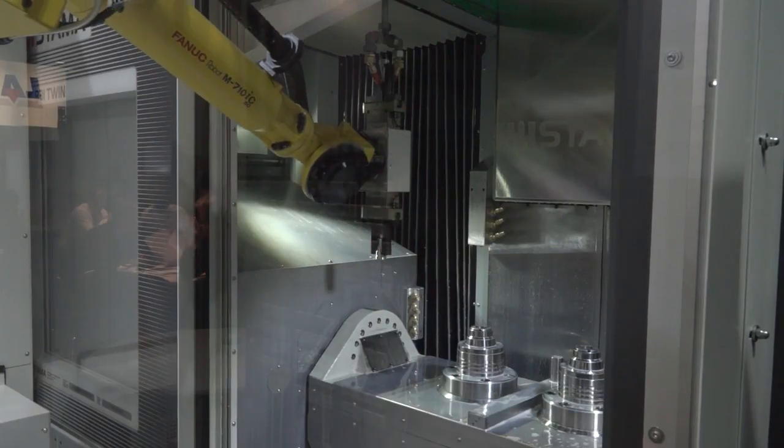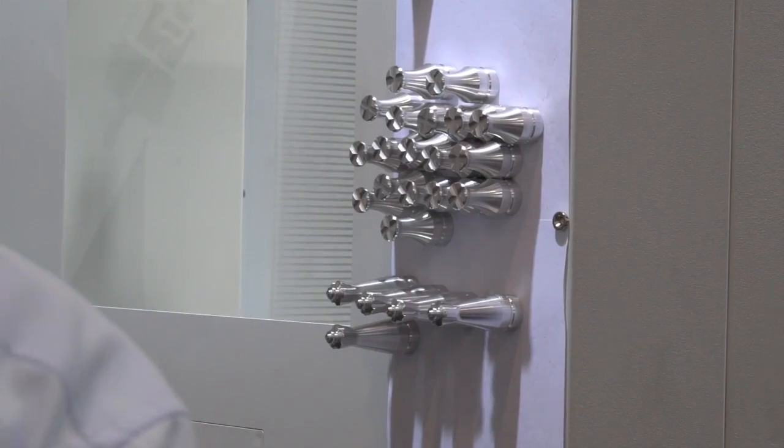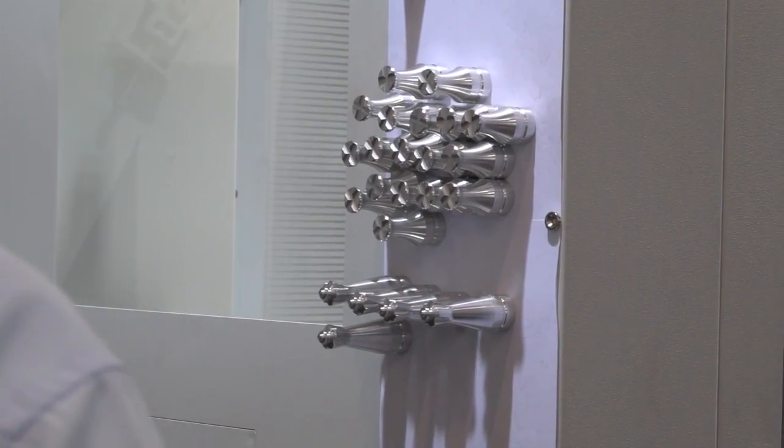And with it being a very fast machine, often with fast machines they're only good for cutting aluminium. That's not the case with this, is it? No, that's not true. It's not only developed for aluminium or for light material. What we can see here is the 31, which is the smallest model, but the same range goes up to an 838, and then we can have an HSK 100 and 65 kilowatt on the milling spindles. So you're then going into harder materials, challenging parts — absolutely, we are going into cast iron and very tough and stringent materials, yes absolutely.